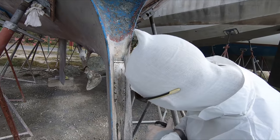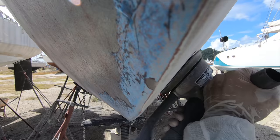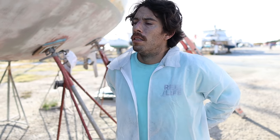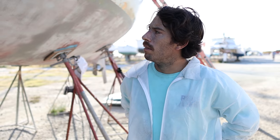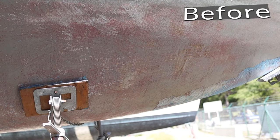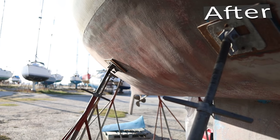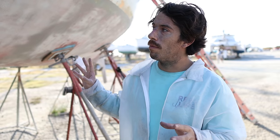That does a good job, huh? I'd say it went well. It's a lot of boat — it's 33 feet — and when you're trying to take off all the antifouling, it's a lot. But we got all of the heavy sections where the antifouling was on thick. I went at all those sections today, and now we've got to go over the whole boat and rough it up or get it ready for a barrier coat.